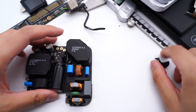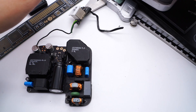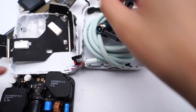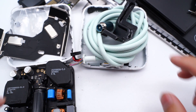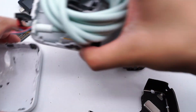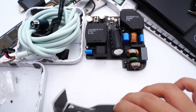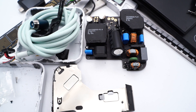That's all the components for this Apple 143W power adapter. We've torn down lots of Apple PD chargers, but it's the first time for us to take apart the iMac power adapter. They look the same but are different inside — for example, the Ethernet port, which is a pretty innovative design. The power cord is fixed by three screws, so it's very easy to swap power cords of different colors in the factory. Most components come from renowned brands like Infineon, ON Semiconductor, and Rubicon, so it maintains Apple's consistent high quality.